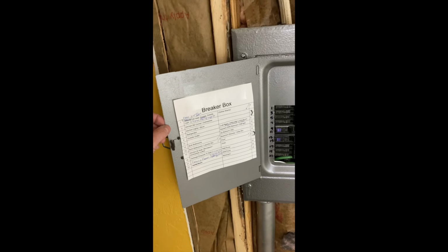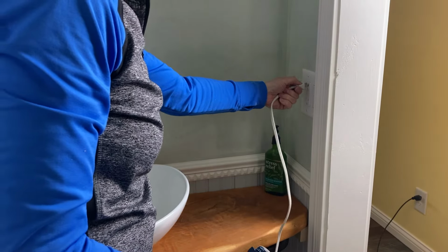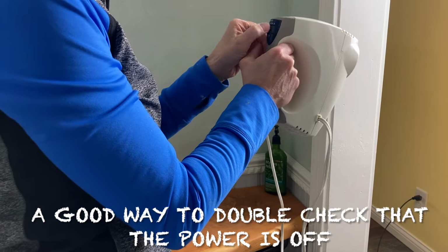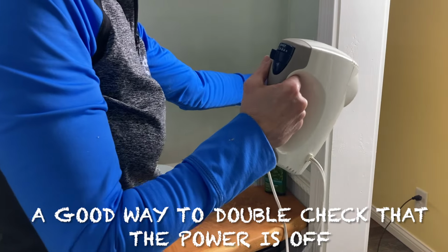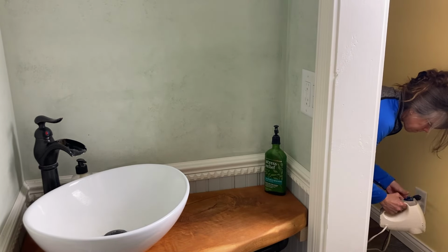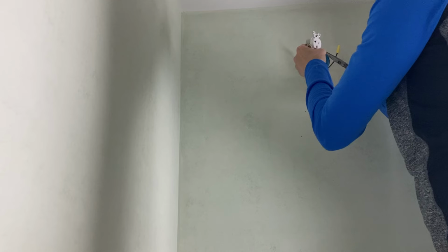Turns out that even though I thought I was planning ahead, I really didn't foresee the whole totality of the problem. Once I was trying to install this on the wall, this top edge that's mounted to the light box actually wasn't flush and it smashed against the wall so tightly that the bottom of the mirror wanted to tilt out. I probably should have routed the mirror depth just a little bit lower. That way the mirror would have set just below the surface of the frame rather than right on the surface of the frame, and then all of the paint sticks would have actually been more flush.